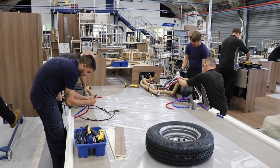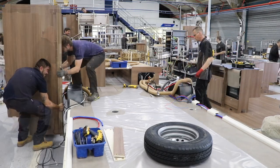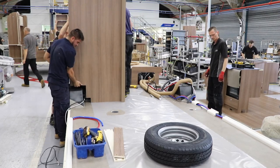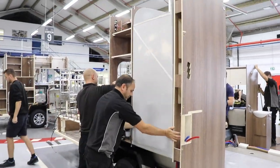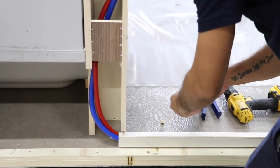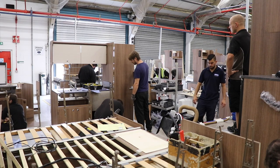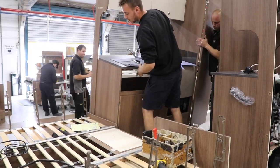These units are pre-assembled alongside the main production line and fed onto the main line on a just-in-time basis. The shower and one half of the kitchen area are loaded on first, and once in place the fully lined shower is fed from the rear. This is what it means when you hear the phrase 'a fully lined shower' — the shower is in one piece, there's no mastic, no adhesive, and no sealant. The never-ending wiring is again fitted in place, in this instance at the rear of the main control panel and behind the fridge unit. Final assembly is taking place of the other half of the bathroom and kitchen, and the cooker is already fitted and currently being secured in place.